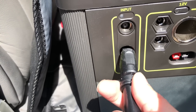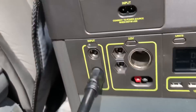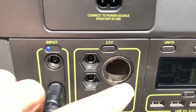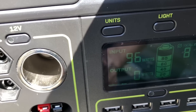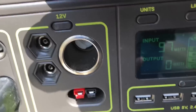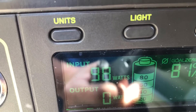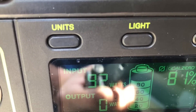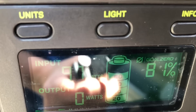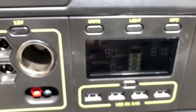I'm plugging into the Anderson port on the PWM controller — it's hard to do with one hand. There we go, it's in. We have to wait for the indicator to turn blue. We're getting about 97 to 98 watts, which is pretty good. Using this PWM controller with the 165-watt panel, it would take about 10 to 11 hours to charge. We're losing about 60 to 65 watts off the panel with the PWM controller.